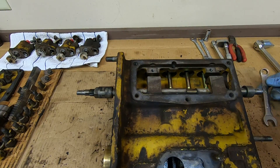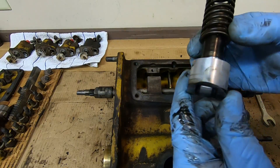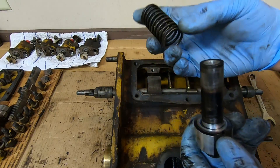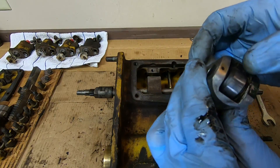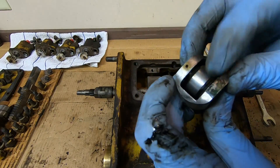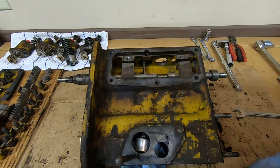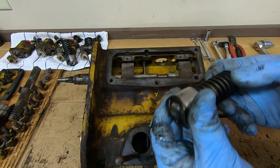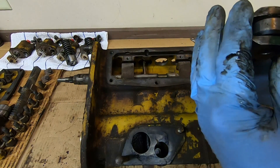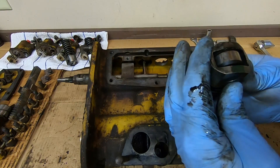There is the lifter. You can see why they don't spin — they have two flats on the bottom, well caged in by the housing. Return spring is there, and this roller rolls — there's a bit of a rusty spot on it. Looking at number two: stuck, no rolling action, and a flat spot beginning there too. Not good.